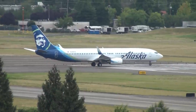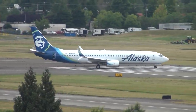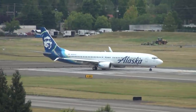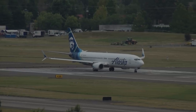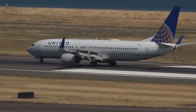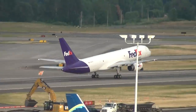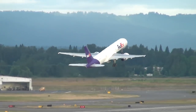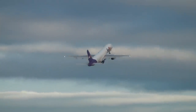Given the differences in the structural design of the various aircraft types worldwide, some planes are more at risk of tail-sitting than others. For example, stretched planes like the Boeing 737-800 and -900 are known to be at increased risk of this phenomenon, forcing airlines to adopt more careful loading and unloading procedures. Freighter aircraft are also prone to tail-sitting and will use tail stands more frequently than most passenger planes. Operators and ground handlers must be meticulously detailed in their loading and unloading calculations to avoid tail-sitting.